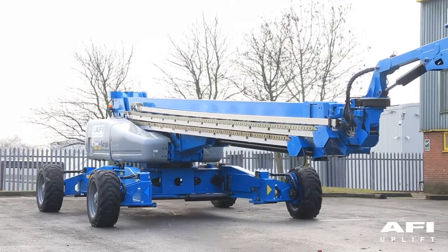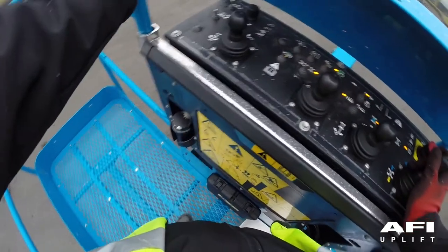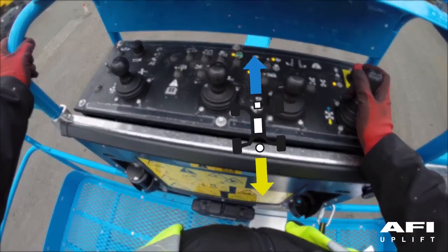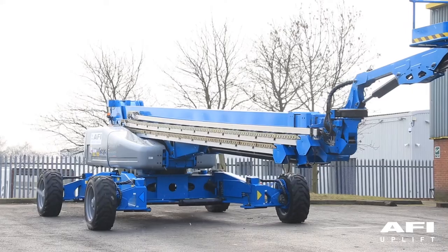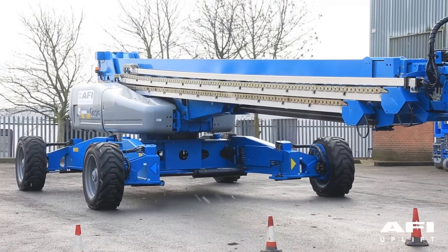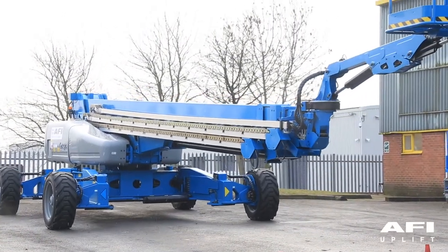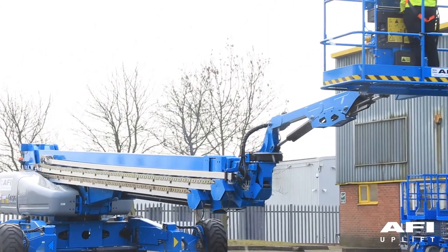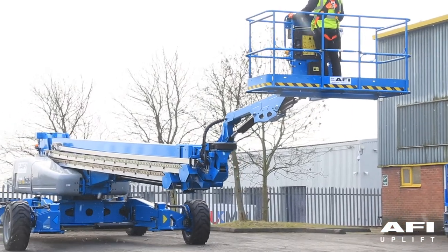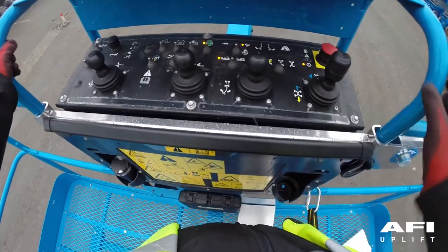Test drive and braking: press down the foot switch and slowly move the drive steer control handle in the direction indicated by the blue and yellow arrows. The machine should move in that direction. Please note the brakes must be able to hold the machine on any slope it is able to climb. When bringing the drive controller back to the centre position, the machine will come to an abrupt stop.